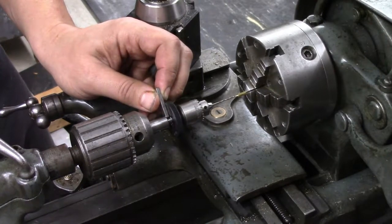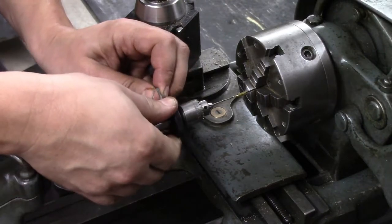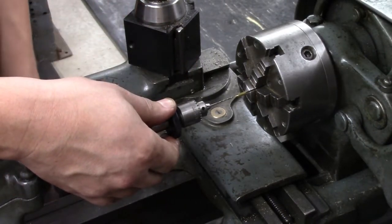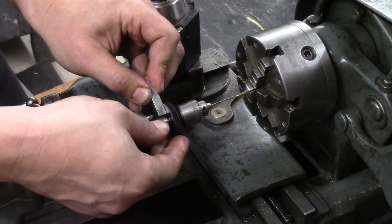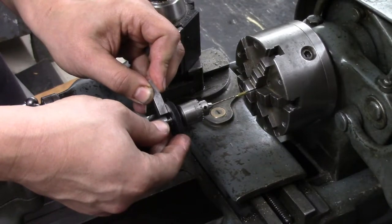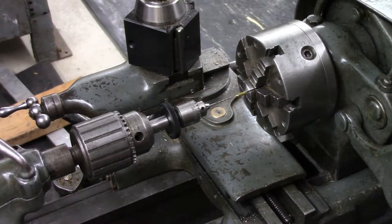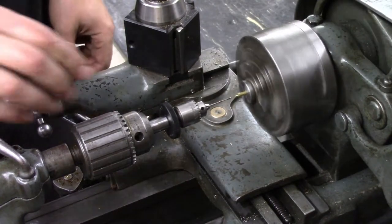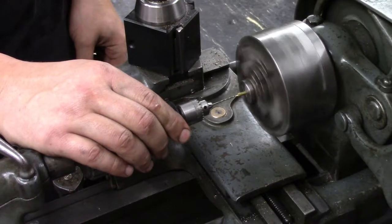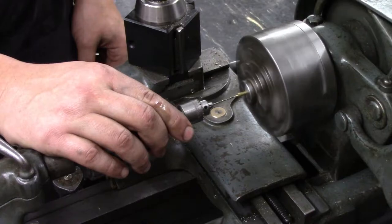And then I'll use a 300 thousandths gauge block. So as soon as that fits in there, I know I've exceeded 175 thousandths deep. Now, as I didn't use the proper center drill, I'm expecting this hole to be a little hard to start. Well, it didn't start as bad as I thought.